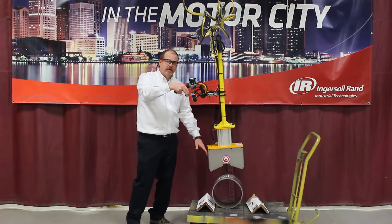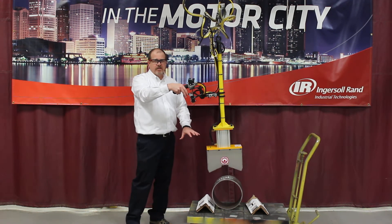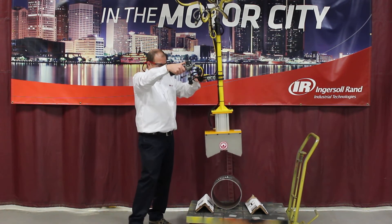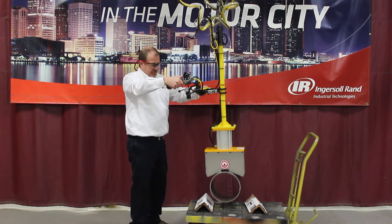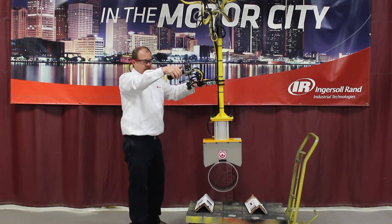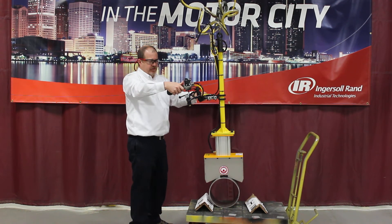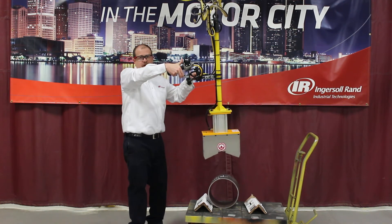Since it is a rare earth magnet, it's going to want to attach onto whatever metal part is near it. So I can go ahead and just leave it and drop right down on the part — magnet on — and lift straight up without any controls other than your up-down. To release, I would go ahead and lower it, make sure my interlock is shifted, and then pull the lever to deactivate the magnet and lift off the part.